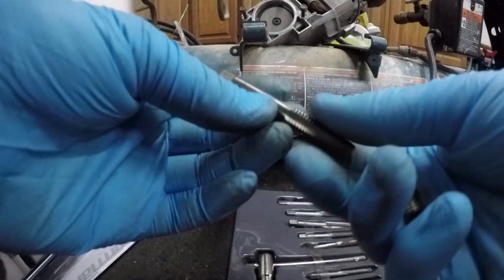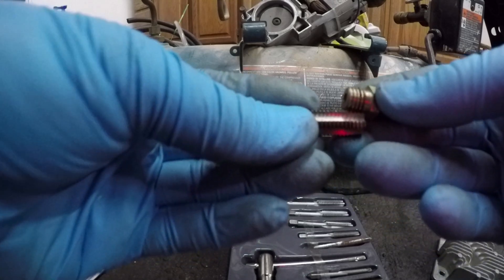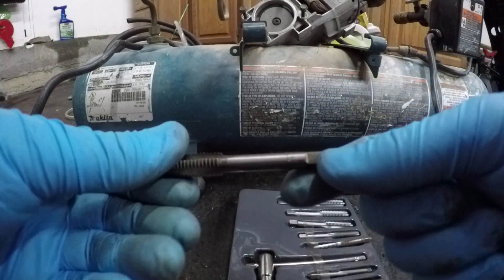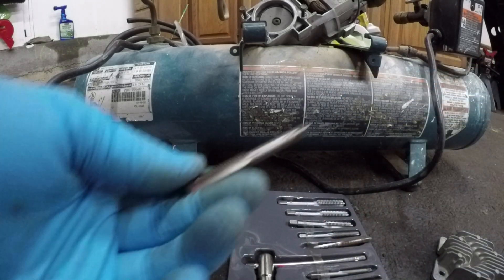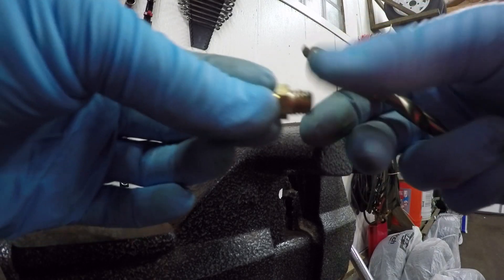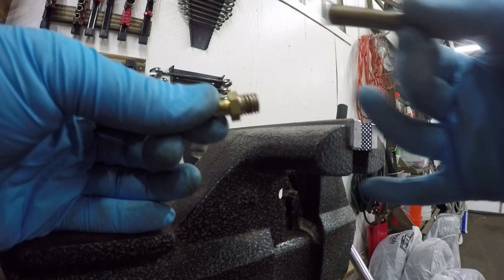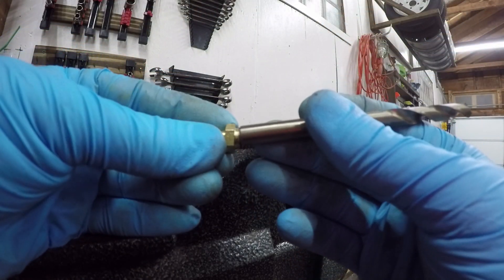Having freed the barbed connector, I took out the tap set and lined up the threads between the taps and the actual fitting, made sure that the threads and the diameter were a match, and that is the tap we are going to use to add threads to that inlet. But before we can do that, we have to pre-drill a hole in the spot, and every tap should say what size drill bit you need to pre-drill that hole. Pro tip: if you just want to do a quick sanity check once you have that drill bit, put the thick end of the drill bit next to the threads of the fitting. The diameter of the drill bit should be roughly the same, maybe a hair larger than the inner diameter if you were to remove the threads on the fitting. Because if you make the hole too large, there is no going back and you have to find a bigger fitting afterwards.